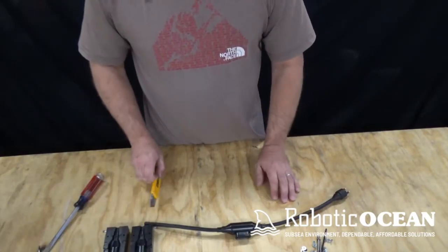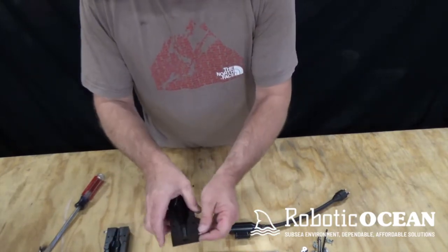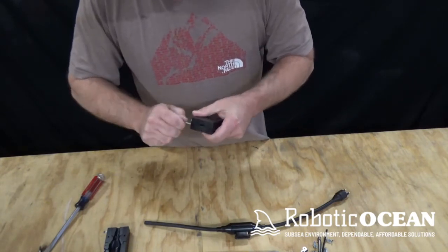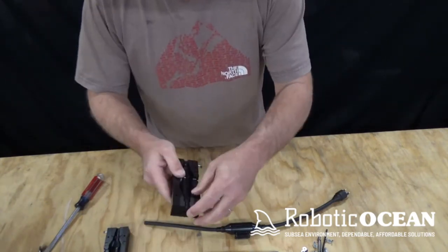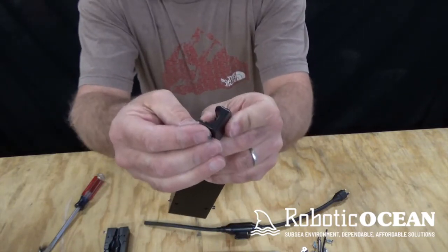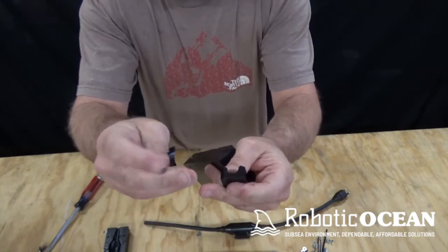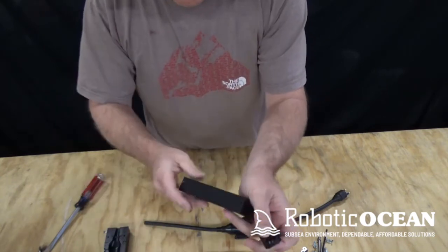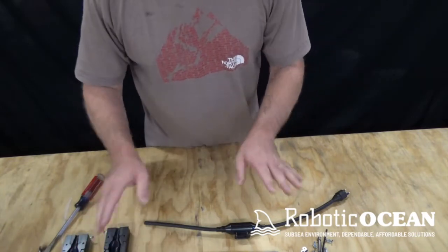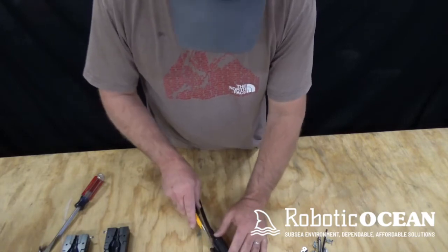Okay, welcome back. We're going to go ahead and cut that off. But one thing I want to show you real quick is, once you're done, you're going to want to be able to pull these pins out. And you're going to want to look at these carefully, because there's going to be a little bit of flashing here and there, again, where stuff leaks out. Because this is Delrin, stuff peels off really nicely. Okay? So you're going to have to go through and make sure that your mold is nice and clean before you use it again. So now we're going to cut this guy off.